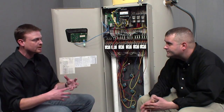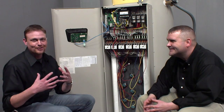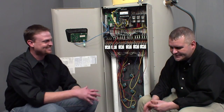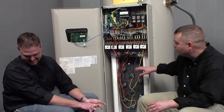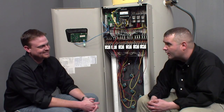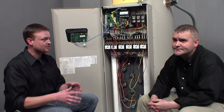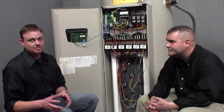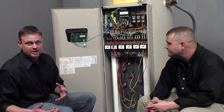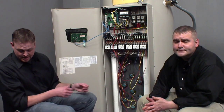Let's go back over everything we covered. All the MACB-built commercial electric products are field convertible — that's electric only; residential products are not field convertible at all. If the kit you need is not on the door sticker, then it's not available. We also cannot change the number of elements — if you have three, you go with three; if it has six, you go with six; if you have nine, you go with nine. On immersion thermostat models, remember to tap the transformer with the correct line voltage.